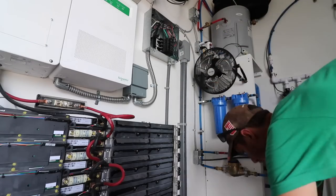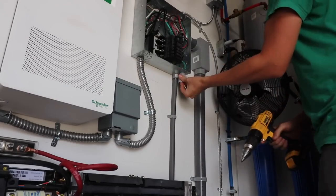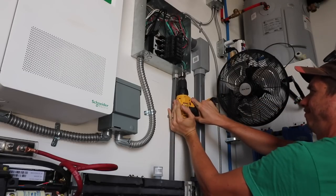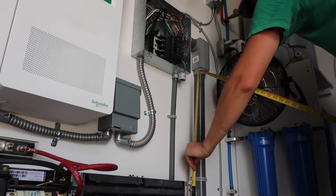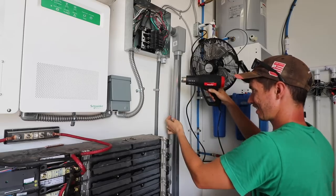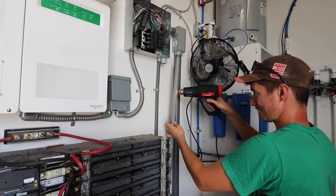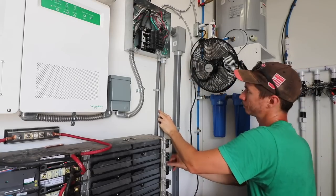In the bottom of the main AC panel there's only a half-inch knockout but I need a three-quarter-inch hole, so the easiest way to do it is just to use a step-up bit — hole saws are not really good for trying to bore out bigger holes. A big thanks to my business partner Liam for leaving this heat gun so I can heat up the PVC pipe. When you want to make an offset using PVC, just heat it up, get it into place, and then let it cool while you're holding it.